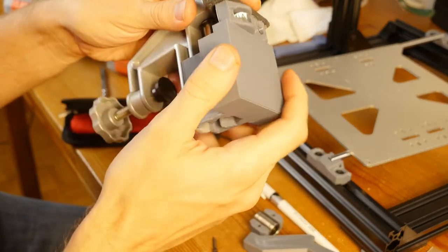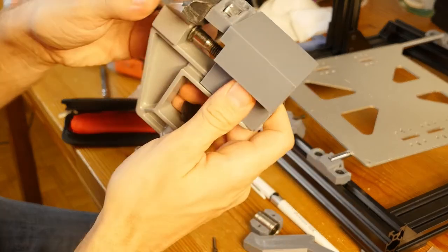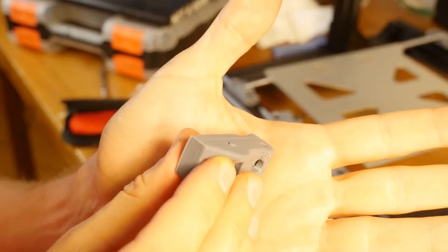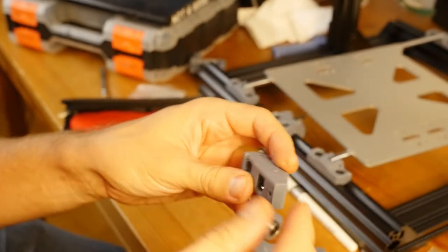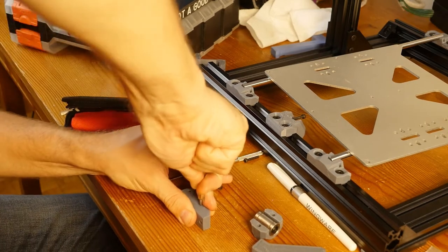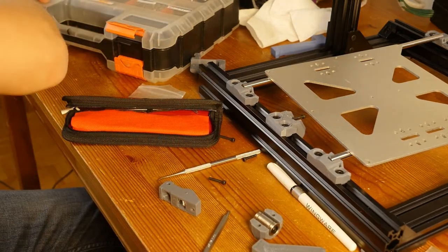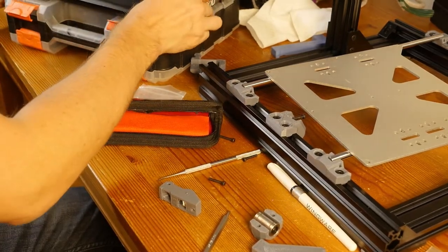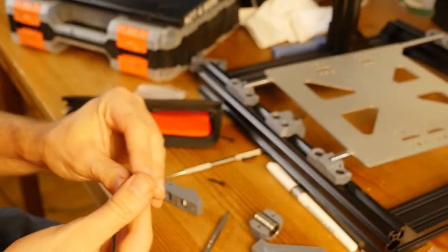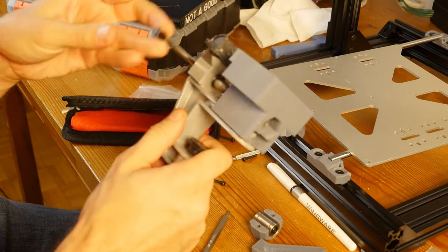I 3D printed the part that broke on the vise, so I'm not sure how much I can pull without this part breaking. This is sort of like my initial prototype that I'm not entirely certain of. This is enough for the tensioner to work properly, but I still don't like how uneven this thing is. So I'm just gonna take a driver bit and press this thing on a bit more. Or what else I can do is I can grab a short M3 bolt, like the 10 millimeter one right here, and I'm going to press it against the idler in the vise and hope that I can totally get away with that.